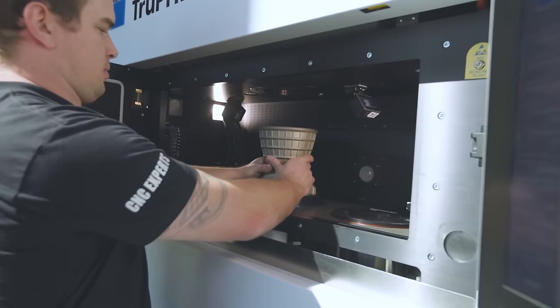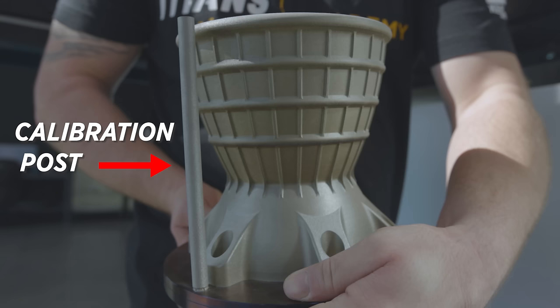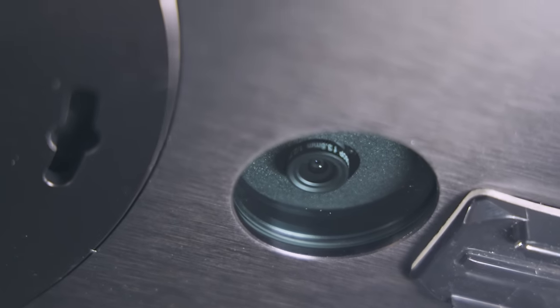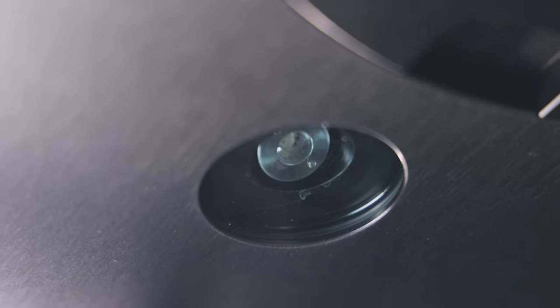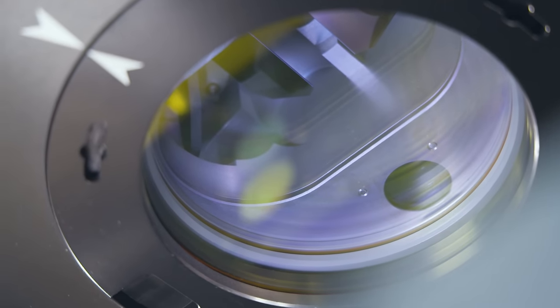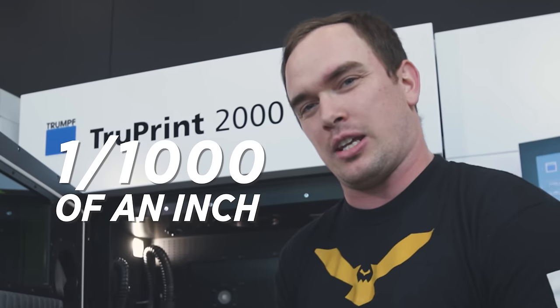Our print's finished — turned out beautiful. These blades look really nice and sharp. You guys might be wondering what this is. Well, this is a calibration post. It prints every layer and the machine has high-resolution cameras to take pictures of it and look for any deviation between the two lasers. If it detects deviation, it'll actually calibrate those lasers back into spec within a thousandth of an inch during the print.